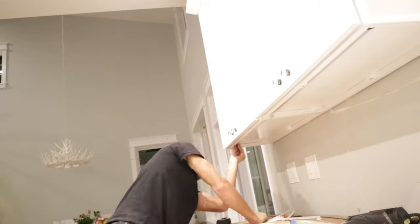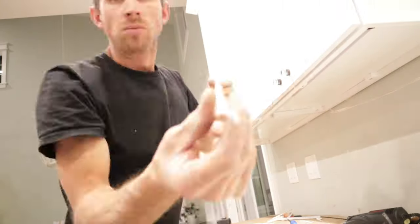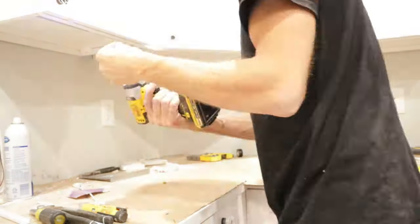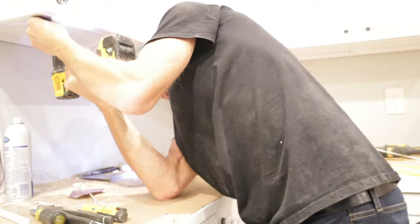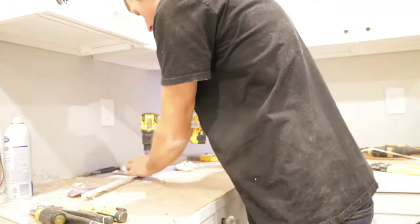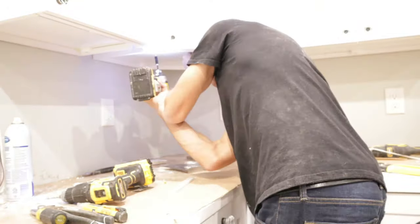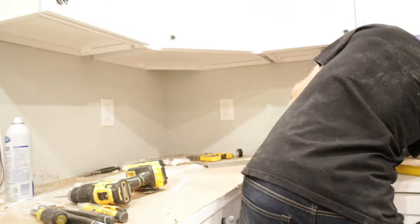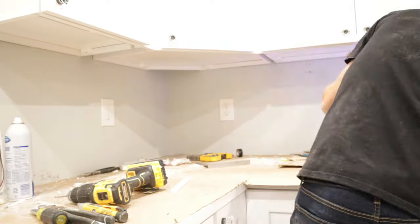I also had to cut my diffusers to length - two pieces of frosted plastic, just like my channel. There we go - it looks like a tube of light, beautiful! I got my first set done. The other side took a little longer because I have a 45-degree cabinet to deal with, so I mitered my channels at 45 degrees. I'm attaching to the bottom of the cabinet with some shallow self-tapping screws - just make sure not to poke through the cabinet bottom, which I think is three-quarter inch or maybe half inch.